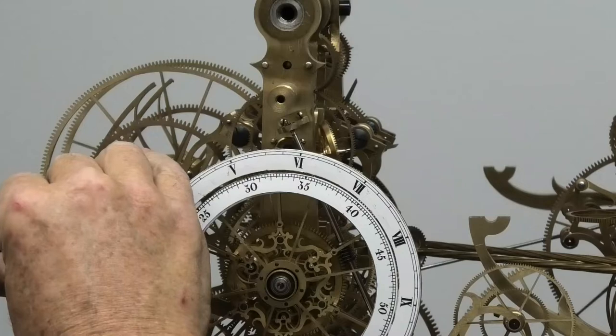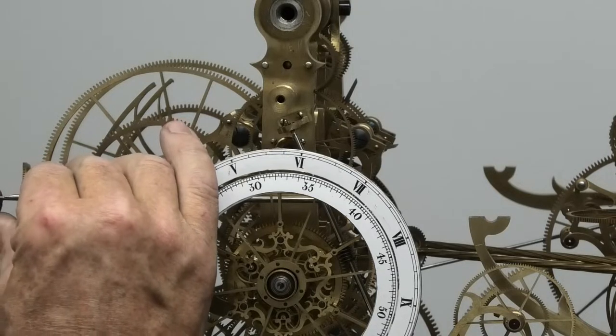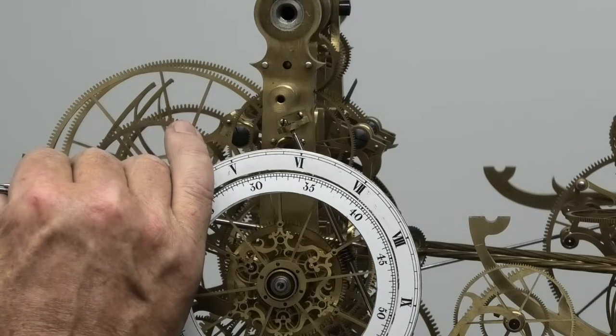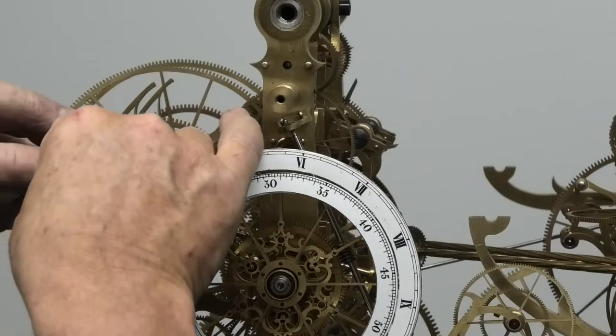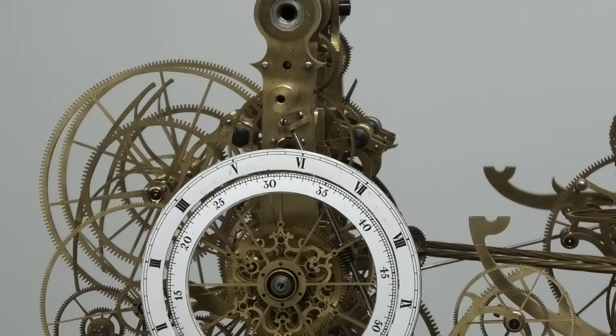It's one point of the design that I could possibly say is a bit of a doubt, and it's best to just remove this gear from its collet, to remove the gear completely from the clock, as it's rather awkward to unthread. And it's best, as always, to replace it immediately afterwards. If you leave these screws slightly loose, it'll be a good reminder of which side was removed and which side is less vertical.